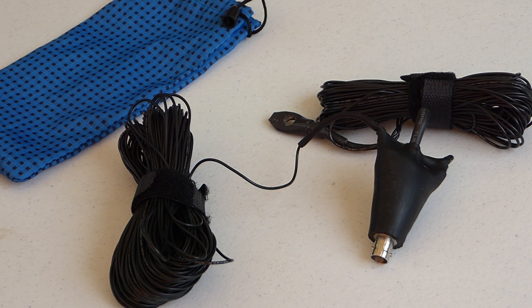This antenna can be used in any of the standard dipole configurations: flat top, inverted V, sloper, vertical dipole, or wire vertical with counterpoise. One look at the N9SAB 80 metre OCFD confirms this antenna has been solidly built and is well suited to the rigours of portable operation. The wire used is 24 AWG stranded UL1007 tinned copper antenna wire with ring connector eyelets at each end. All electrical connections are soldered using silver bearing rosin core solder. All parts and connections have been weather proofed using marine grade adhesive lined shrink tubing. The antenna terminates in a BNC connector, which is the preferred choice for most QRP operators, with a nice touch of an included BNC protector cap.